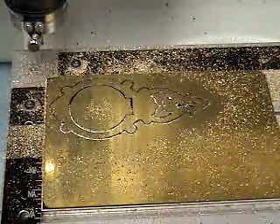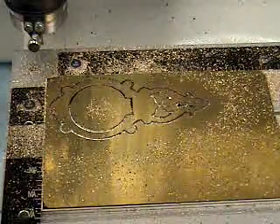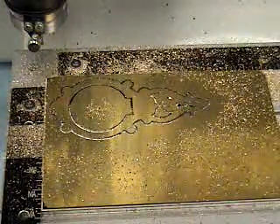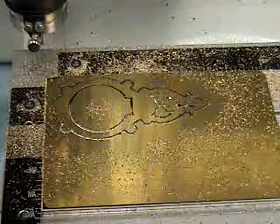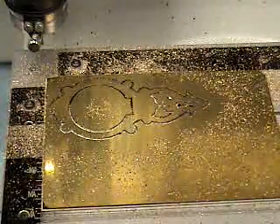This brass is black on white, and you can see some areas of black, some areas of white, where the cutter went a little bit deeper. The tape underneath the plastic causes it to be a little bit higher in some areas. But it does a nice job. This brass is 40 thousandths thick — it could easily have been done on thicker brass; it just takes a few more passes.